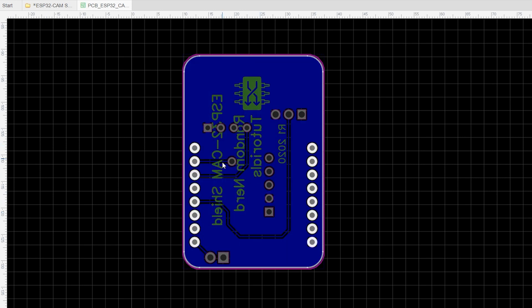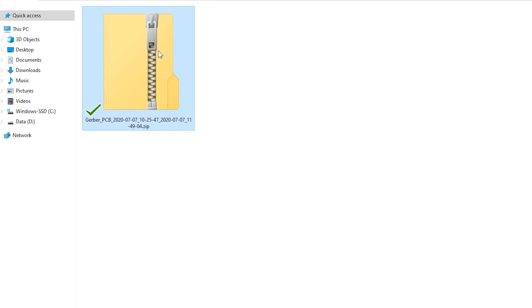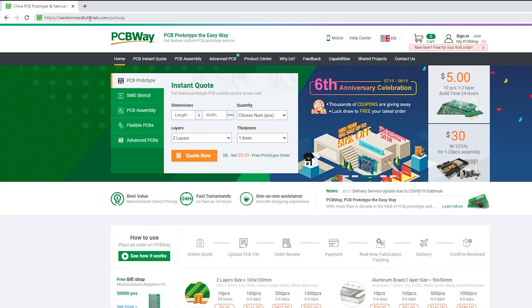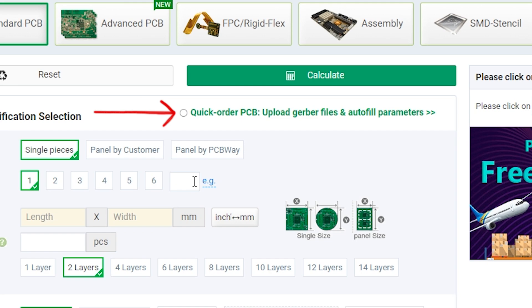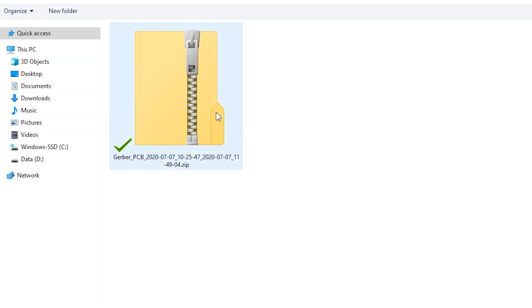Save your project and export the Gerber files. Once you have your Gerber files, you can order the PCB. If you don't want to modify the PCB, you can go to the project page below and download the Gerber files provided. Click the first link in the video description to go to the PCBWay website and open the PCB Instant Quote page. PCBWay can grab all the PCB details and automatically fill them for you using the Quick Order PCB Auto Fill parameters. Press the Add Gerber file button to upload the provided Gerber files, and that's it.